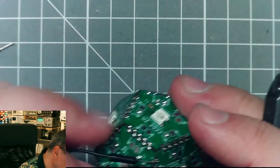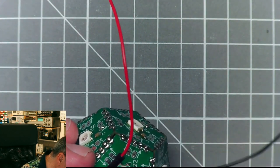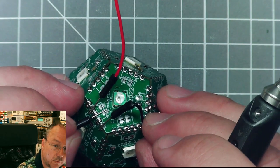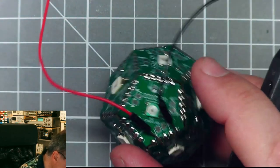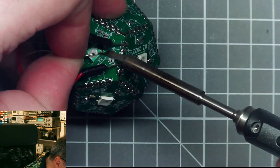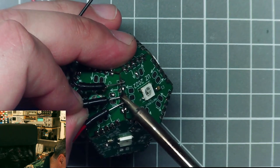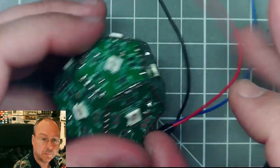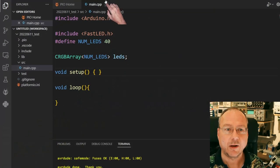Come on. Like this. And now I have to connect to a data pin, an incoming data pin. And that would mean I have to connect to this jumper here. Since there's nothing soldered here, I can actually solder it either to the pad or here to the castellated connection. If I use a castellated connection, then I have to set the jumper bridge though, so that we have an incoming signal to this LED from the middle pin on the castellation. Like this. So, could that be it? Today, in order to just have a quick test, I think we can do it like this. Let's start with a fresh project